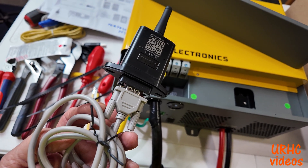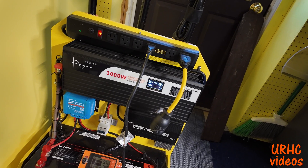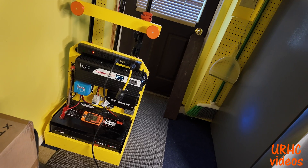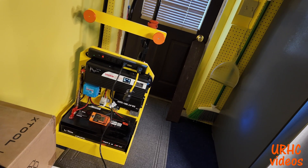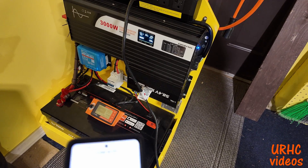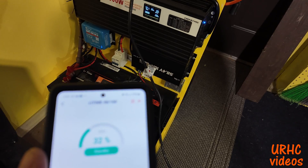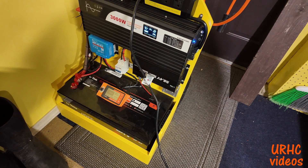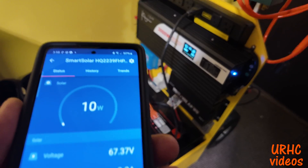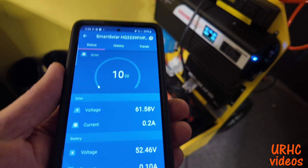There's a Wi-Fi dongle that took me a while to get the app working, but once I did, it worked great. Here's that system I've been running the pole barn on all summer — I moved it inside to run a couple of freezers the last couple of weeks. I've had excellent luck with it until we got into a really dark, dingy couple of days in a row, and after three days you pretty much run out of battery power. I didn't really plan on all the inverter draw — there's a lot of vampire draw from these inverters and they do cut down your run time. On a cloudy day, I'm lucky if I get 10 or 11 watts out of the two panels I've got out there.